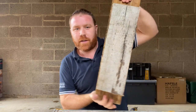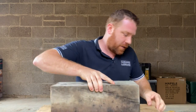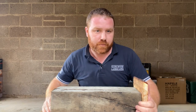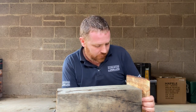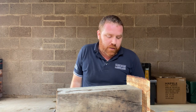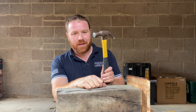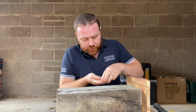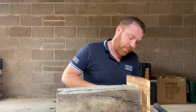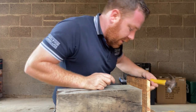That's now nicely fixed. You can start to see how this is going to look when it's hung on the wall. Next is the top plate — you can see it's got a slight overhang either side. I'm going to put a few nails in the top rather than screws because screws are likely to split the wood. I've got some 60mm stainless steel nails — I'll just put four of those in the top to fix the lid to the main part.